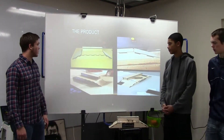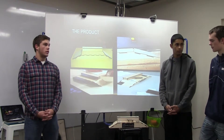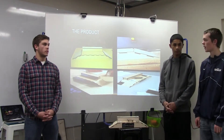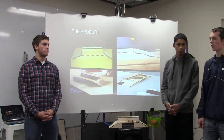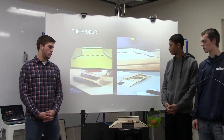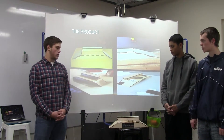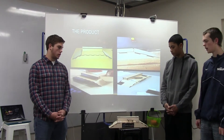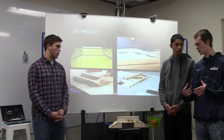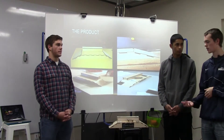The product. What we used was a quarter inch thick plywood, 20 by 16 inches. We designed it on Inventor and then programmed our laser cutter to cut the specific dimensions out of the quarter inch thick plywood. It has a hollow bottom, and these notches are holding it up. It was sliding around sometimes, so we grabbed wood glue and glued it all together, and now it stays perfectly solid.